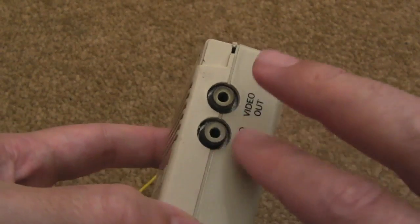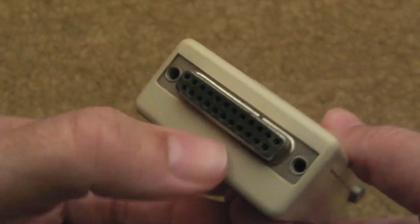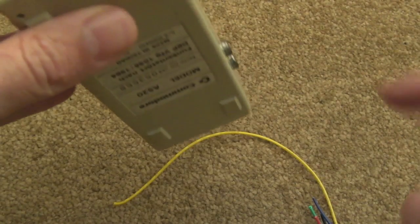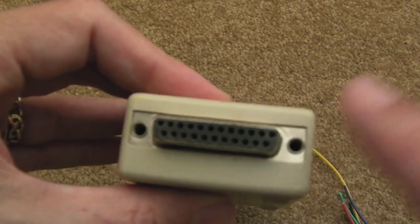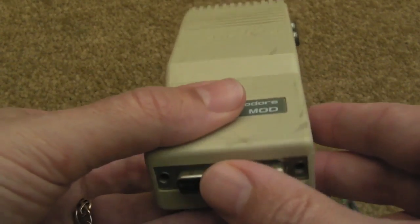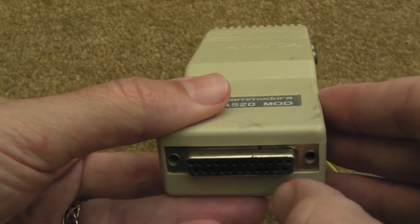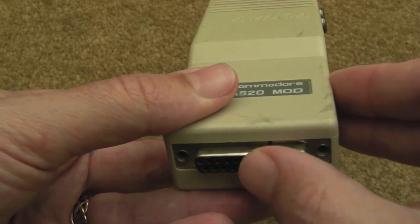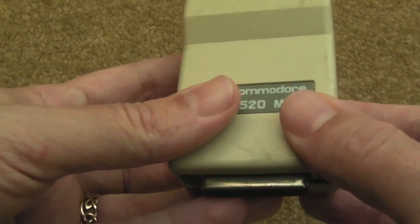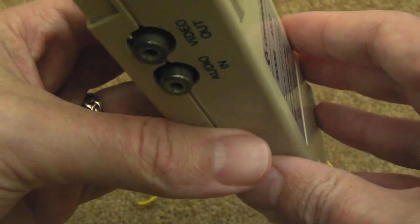I'm going to leave this functional — you'll still be able to use the video out, composite, and RF. I'll use the RGB pins — red, green, blue — and the sync pins, which probably need merging together and feeding through a resistor. The sync output on the Amiga is something like 4.3 or 4.6 volts, and the GBS-8220 upscaler is apparently not 5-volt tolerant on its inputs — it only accepts up to 3.3 volts. So you need to add a resistor in series. The article I read suggests 680 ohms, so that's what I'm going with.